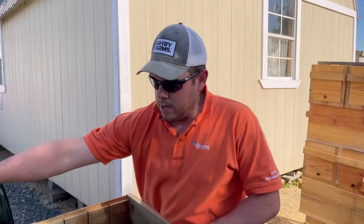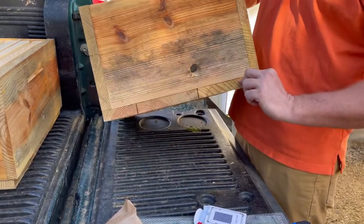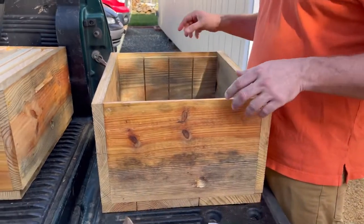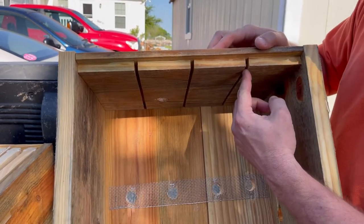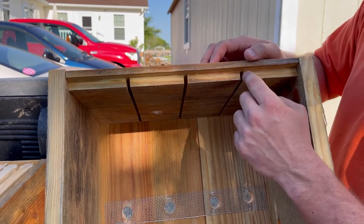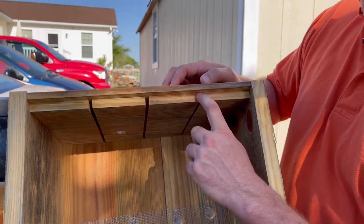Our queen castles are 10 inches deep and they've got a bottom on them. I have all my wood custom milled — it's one inch thick. We run three grooves that are a quarter inch wide, which is two dado blades, and I run them to a depth of five eighths of the way to the edge of the bar. That'll come into play here in just a couple minutes.